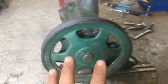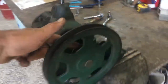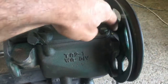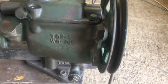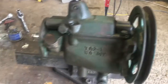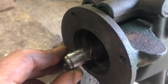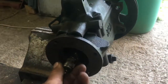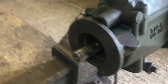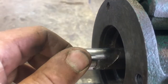There are variants that are direct mount, but this one's called the cross-drive variant, where it's got an additional bearing added here to handle the overhung load of the belt. It's a big, beefy roller bearing — really nice. On the output shaft, output side of this one, currently in neutral, there's damage where the key tore out some of the shaft. The half-moon or woodruff key seems to have sheared off part of the output shaft here — it probably slipped, chipped, and dragged. But it's still working.